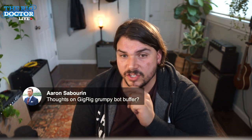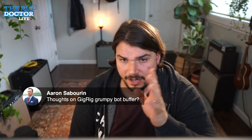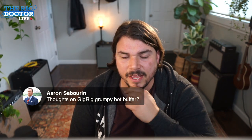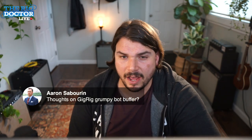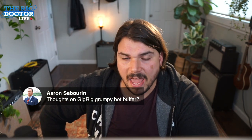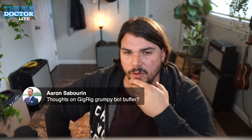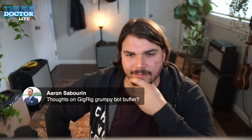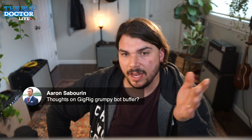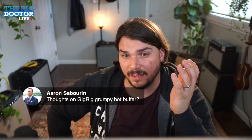But the only small one that I've seen that actually is really good is made by Creation Audio Labs, not Creation Audio Company. This is called Creation Audio Labs, CAL. They're out of Nashville, and he has a little tiny discrete buffer that is in the spec. You have to ask him to lower the input impedance though, because he makes them more toward a piezo, so it's super unloaded, like 5 megs or 20 megs. I can't notice much difference between anything above 5 megs. It's pretty hard to hear the difference with the input impedance being that unloaded.